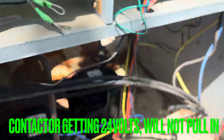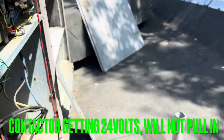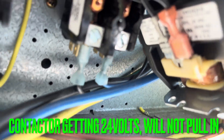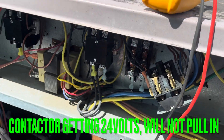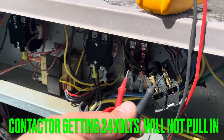But this coil will pull in — you can see. And we're not going to get a fan because it's not hardwired, it's not high voltage. But you've got your coil pulled in there, right? I always had my 24 volts; it just wasn't enough to pull in a 240-volt coil.